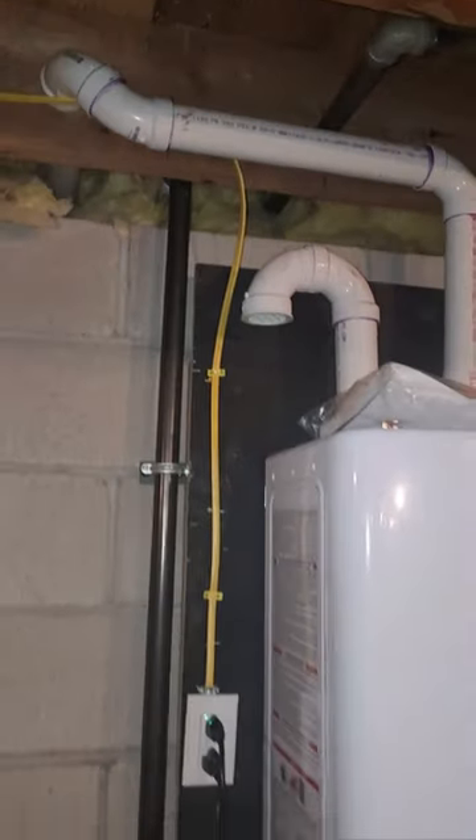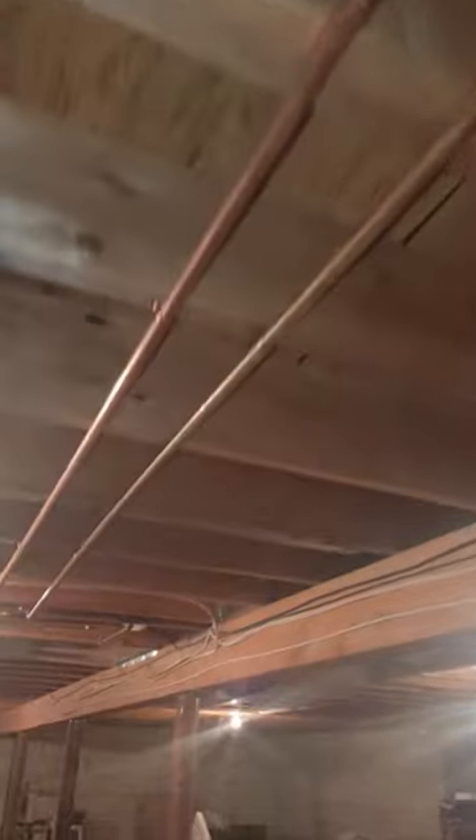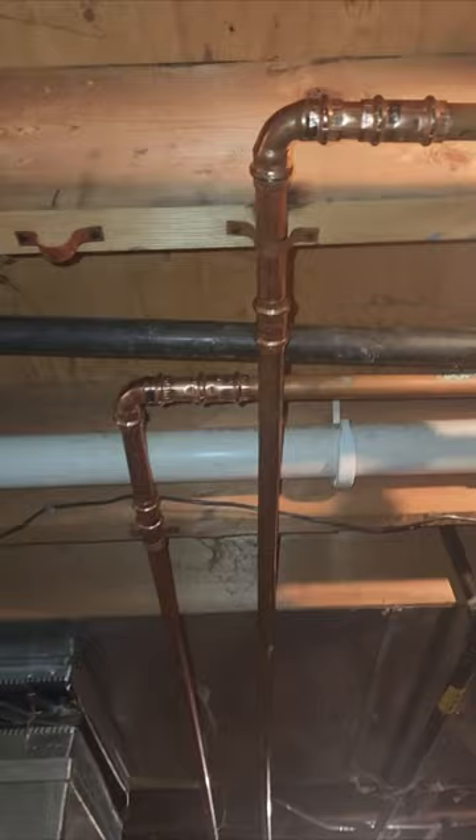I'm showing the electrical — that's all done. That white box in the back was the acid neutralizing pump. The reason we installed an acid neutralizing pump is because the condensate for this unit is acidic, and it's going to be pumped to the main drain. We want to neutralize the acid out before we discharge it. State code says we don't know what's underground, so we have to neutralize just in case it's cast iron or galvanized — to avoid destroying the pipes. That's it guys — any questions, don't ask, cause I don't know what I'm doing!